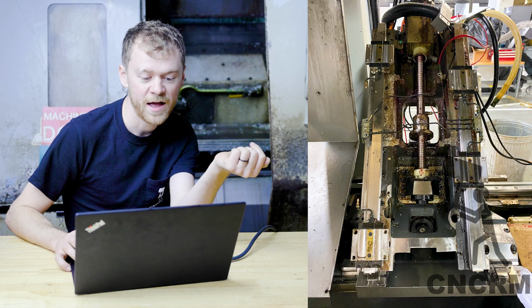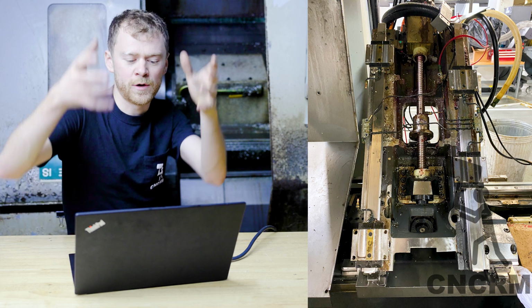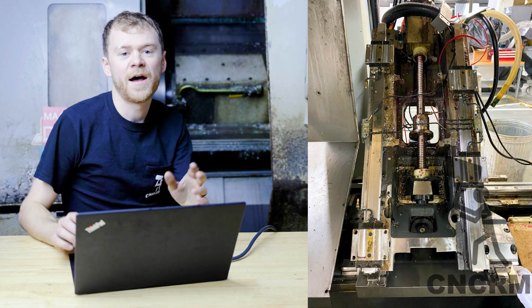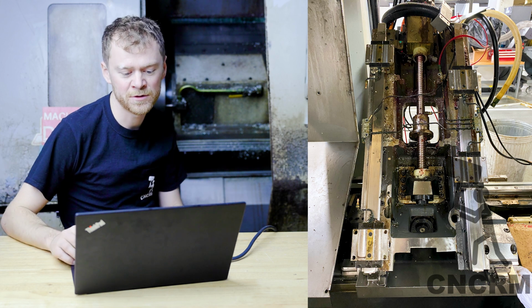Subplate comes off, and a couple of these rails were cracked. There was no preload, so they fell down. I already had disconnected the lube line, so I didn't bend a lube line. I actually reused those lube lines.